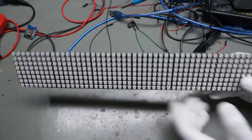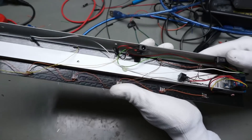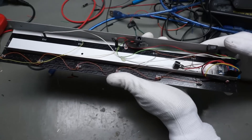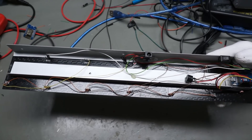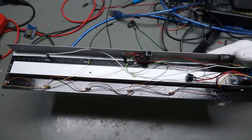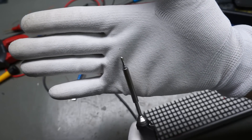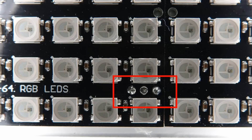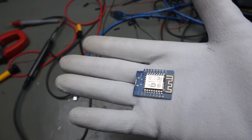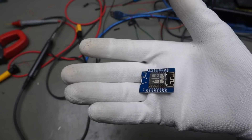I used wire wrapping for that purpose, and I was happy about that decision because I had to remove some wires when I made mistakes during the process — of course, nobody had told me the tricks before I started. That was the reason for the head scratching. Tip or trick eight: use a tiny tip on your soldering iron to solder the pins. Because you have to do that on the front side, the chance to harm NeoPixels is big.